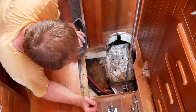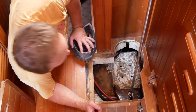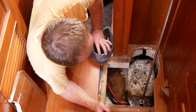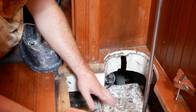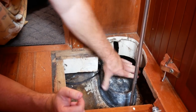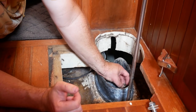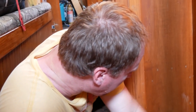They've actually glassed over this step, which has helped insulate and protect the step and the base quite a bit. The threads and fasteners came out without any signs of corrosion, really. So this has got a lot of life left in it. Our choice with Chris the rigger is not to go to all that effort right now — we've probably got a good 20-plus years still of life out of this. Chris is going to put in a thickened epoxy to level it out and give it a nice level playing field, then set it in place with some 3M 4200. We're in good shape — that was probably our biggest worry, and we're excited to get the mast back on and go sailing.